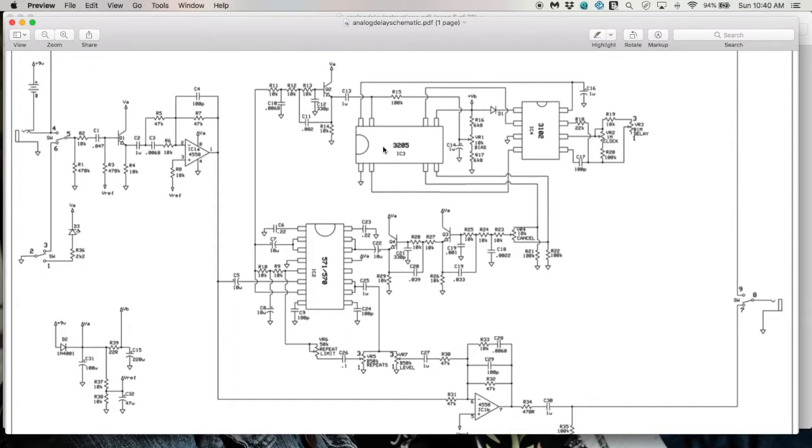Now the speed of the sampling is all based on the clock being generated over here. And that is controlled by your delay control, which is on the top panel of the effect. Give it a longer delay, the clock slows down, and the charge going through this line of capacitors gets slower. Reduce the delay, the clock ticks faster, and charge goes through there a little faster. Now the thing about bucket brigade devices is the capacitors inside this chip are only so large, so you have to do a bunch of careful shaping of your signal in order to make it so this chip is not overwhelmed. Hence the compander chip over here.